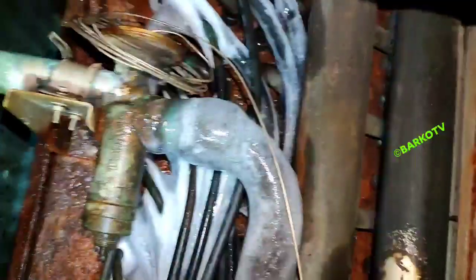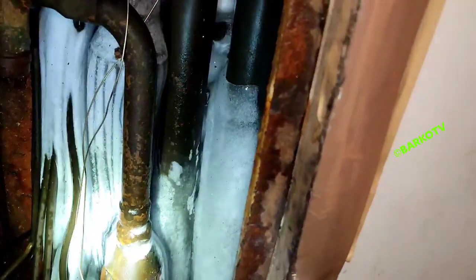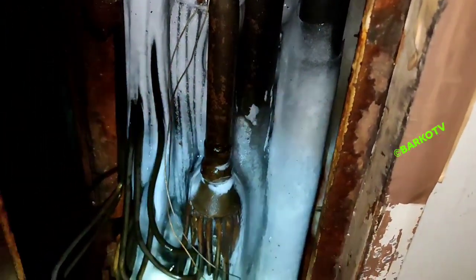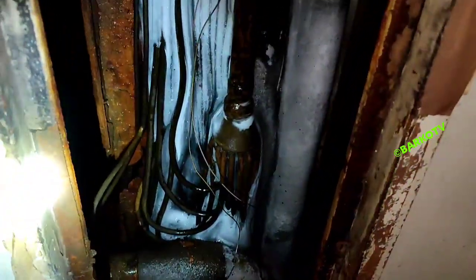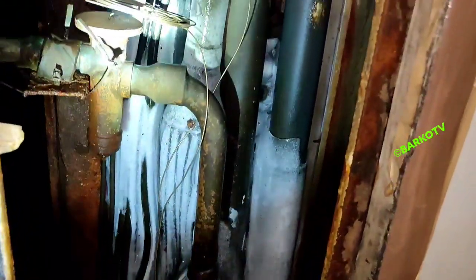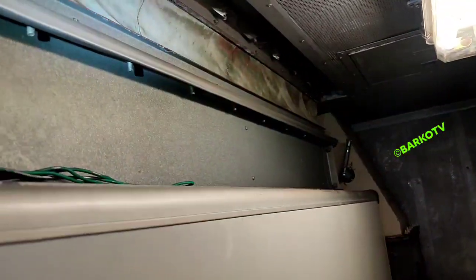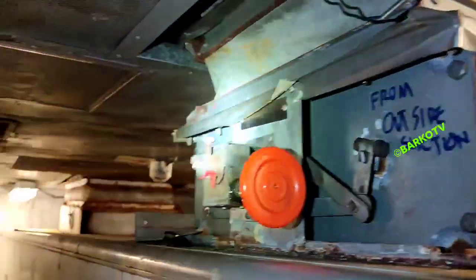We are here at the fan unit — the air handling unit — and at the evaporator side, you can see the evaporator is full of ice. The first thing we do is pump down: pumping down compressors one and two, then waiting for the compressor to totally stop. We also have a separate video about pumping down the system — just check my channel.